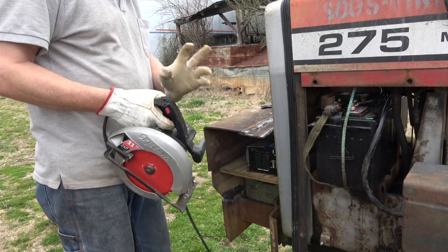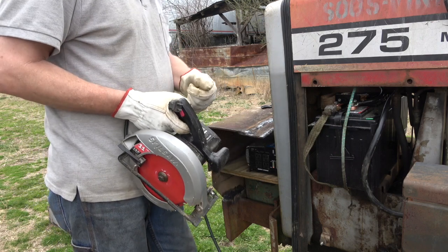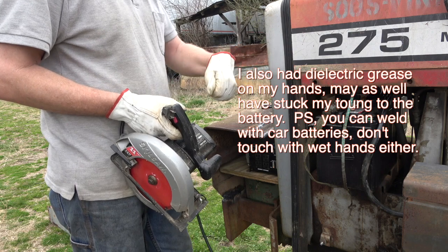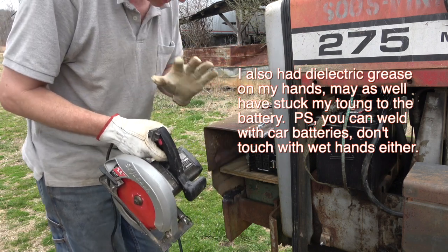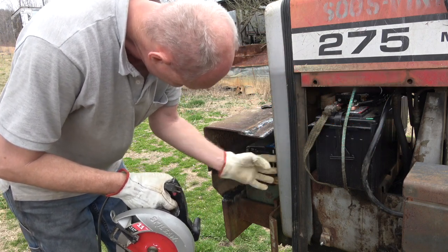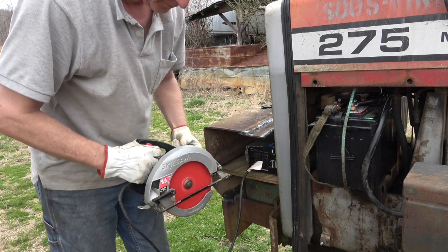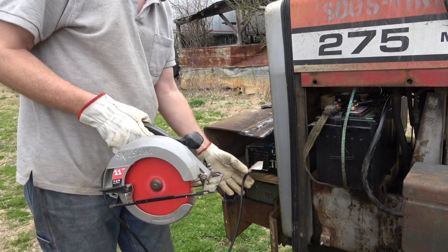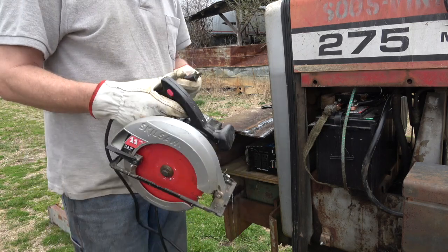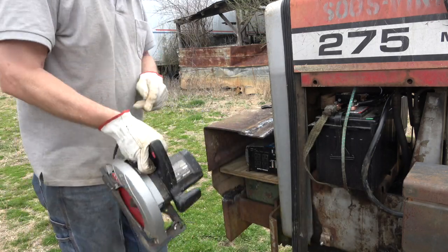You'll notice I'm wearing gloves because I hooked up the last two cables. Because I'm using two batteries, as soon as you hook up one cable, both the cable and the other end of the battery are hot. So I was wearing gloves just to make sure I didn't get zapped. I'm going to turn it on, plug it in, and I now have 110 power anywhere the tractor is — one of the nicer things to have.